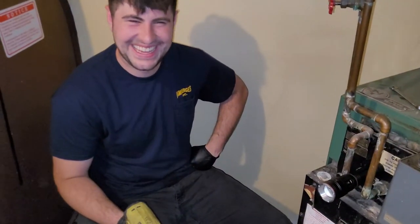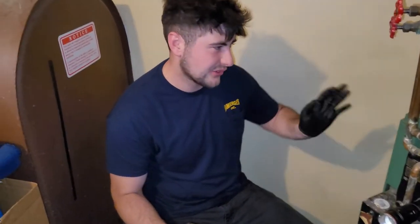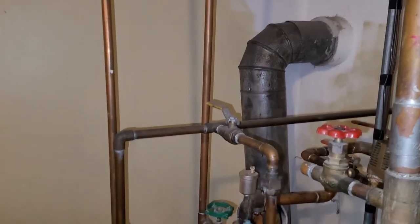Take two. So now that we've finished up the oil side, the only other thing we're going to do with the burner is, at the very end, when everything's clean, run it and test it with our Testo. Testo is the brand name, but it just tests the flue gases. Anyway, we're going to get in here and take the stack off. We're going to vacuum both out, brush them both out, and that's really it.